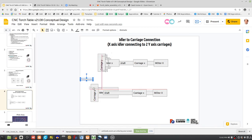You mean this? Yeah. Sure. You can do it. Now it comes down to the production engineering, how much time is it going to take to print, all that. But if you look at this from the top, that's a much bigger piece. Now, if it is a much bigger piece, then we can cut out as much meat as possible and make it lattice-like, so we still save on the print time. Yeah, that's a solution right there.